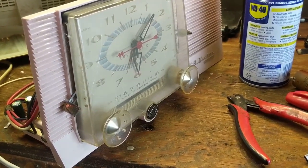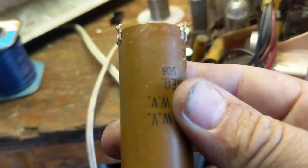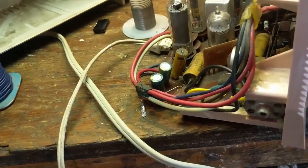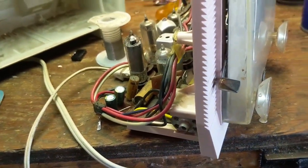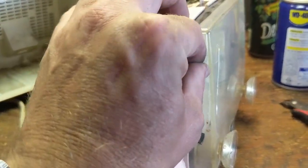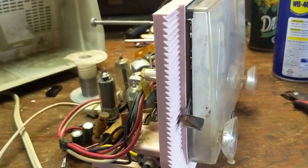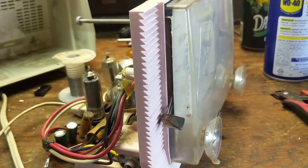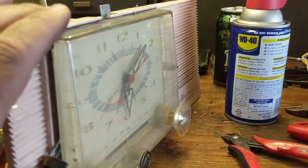It's time to test it out. I have these two tiny little electrolytics that replaced that great big thing I pulled out of there — yay, technology improvements. I find that about 80% of the time, just replacing the electrolytics is all these things need to get the bare basic minimum functionality. So let's go ahead and turn it back on and see if it's an improvement.